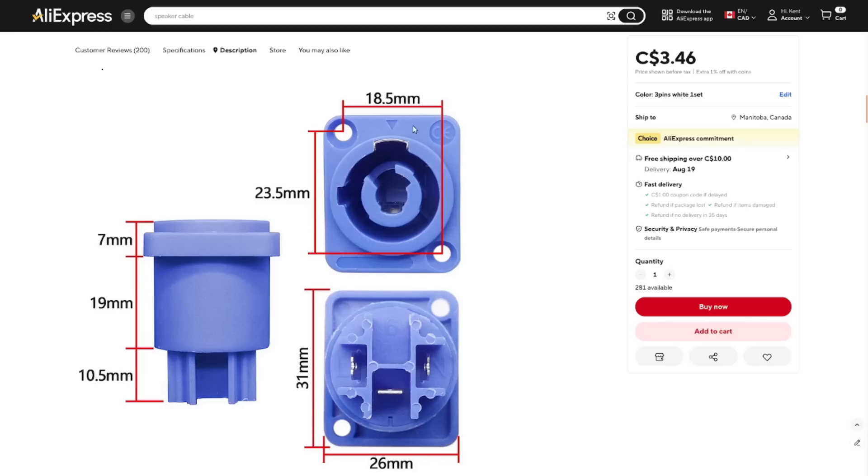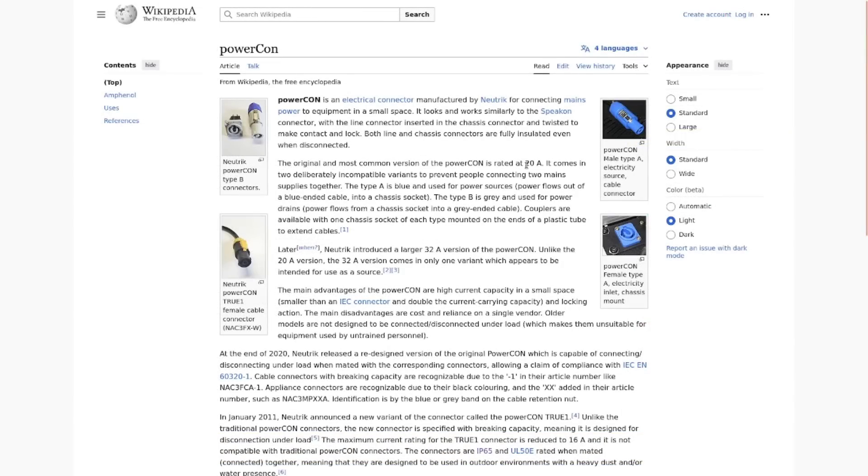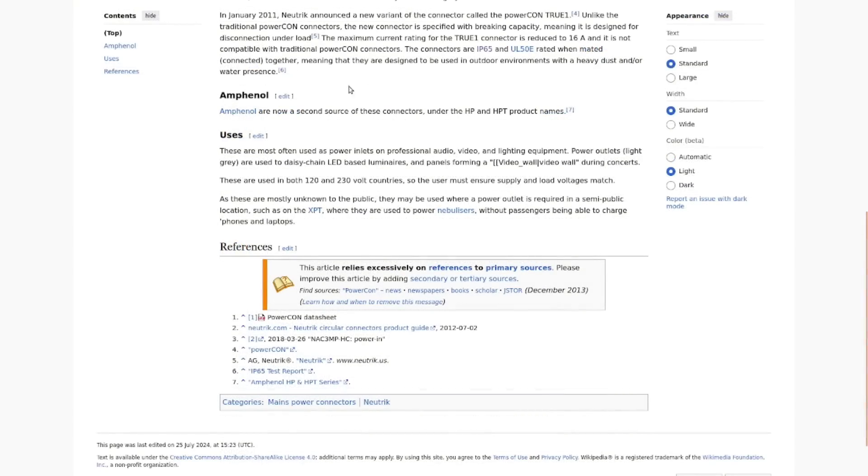The physical dimensions are the same as XLR connectors and other chassis-mount connectors that Neutrik makes, so it takes a standard chassis punch for high-volume installations — nice to keep everything consistent. The spec sheet talks about durability and secure connections. The official Neutrik PowerCon is rated at 20 amps, and since these mate with it, they're presumably also rated at 20 amps. It also turns out Amphenol now makes these as well — of course the ones I got are neither of those brands.